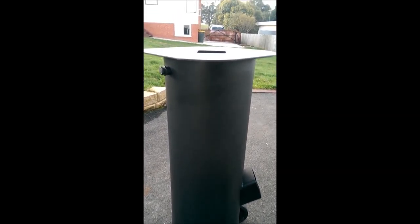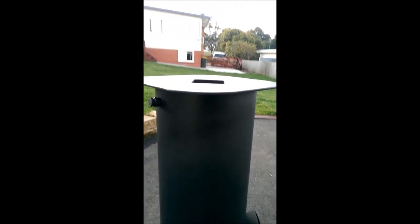The issue that I've been having is underneath these welds — this one here, if you can see it — has actually popped because of the expansion from the burn tube inside getting quite hot. Over that distance it expands about three mil and has cracked the weld of the top plate to the casing, because the casing is insulated. It takes a little while for the casing to heat up, and therefore the plate actually gets a bow on it over the top here — sort of lumps up this way. Because the burn tube's in the middle, it pushes up on that top plate and has broken those couple of welds.